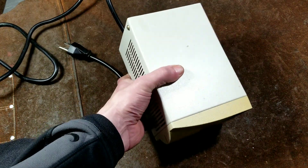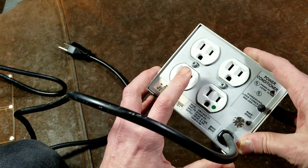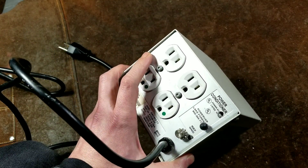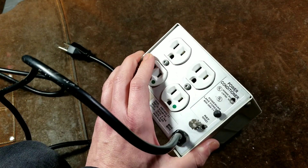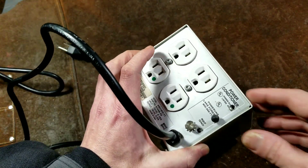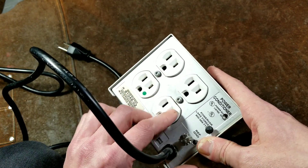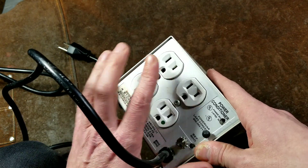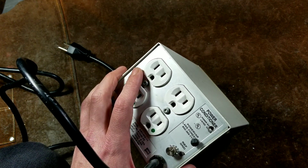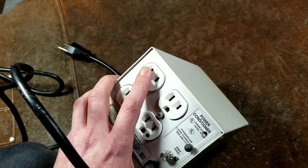These things tend to be pretty heavy. They're also used in medical equipment, and that's actually what this one was from — it had medical-grade receptacles. These smaller units, surprisingly enough, don't have much in the way of overload protection, which always surprised me. This little PowerVar did not have a circuit breaker, so I installed a push-button circuit breaker — this isn't stock. But it did come with these green-dot hospital-grade receptacles, and hospital-grade receptacles are just super high-quality. They're like specification-grade receptacles, except with a bit higher quality control. Oftentimes they are nylon-bodied.